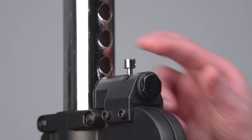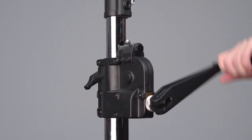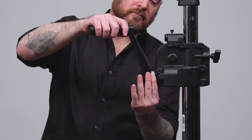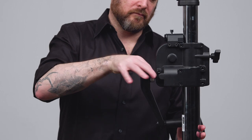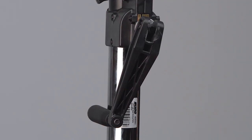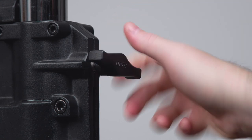When the auto lock is disengaged by flipping the lever to the other side, only then are you able to lower the riser section. The handle can be inverted for easy storage and transport, and it can also be used as a safety feature since the handle cannot turn when placed against the column. There is a knob that activates a brake to lock the column once the desired height is achieved.